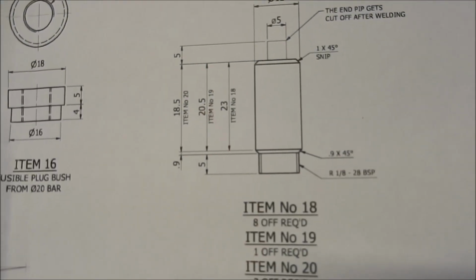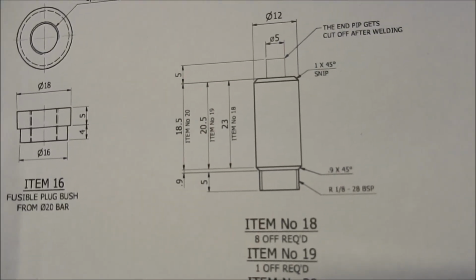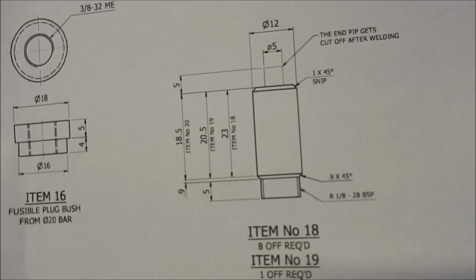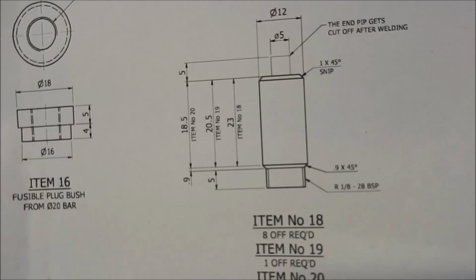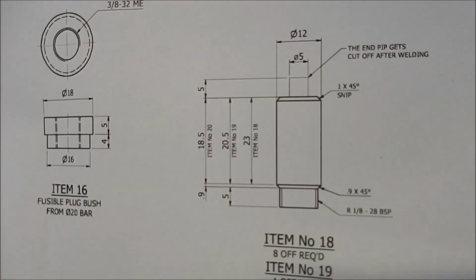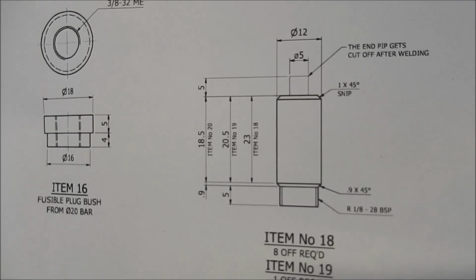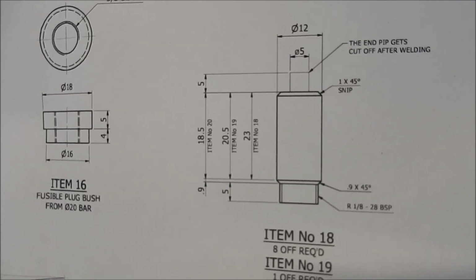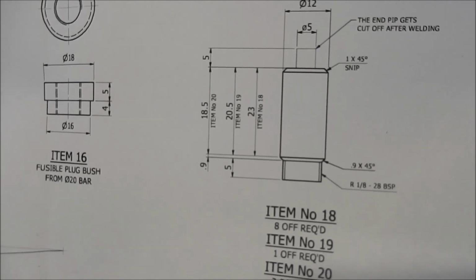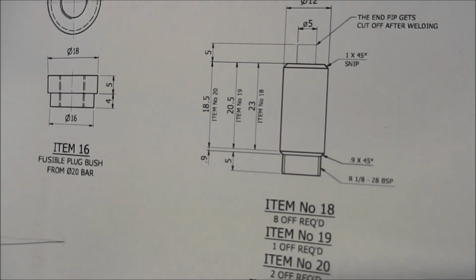Righto guys, we're back again looking at machining up the stays with this 2205 Duplex stainless steel. I've done a little bit of research and rung around a few shops that actually work with this stuff and got a bit of a hint. It's important to keep the speed slow and feed rates up. It's important not to let the tool dwell or rub, because as soon as that happens, this stuff work hardens